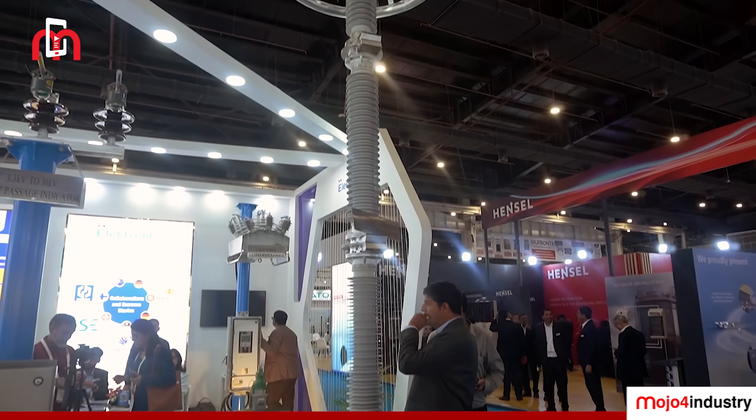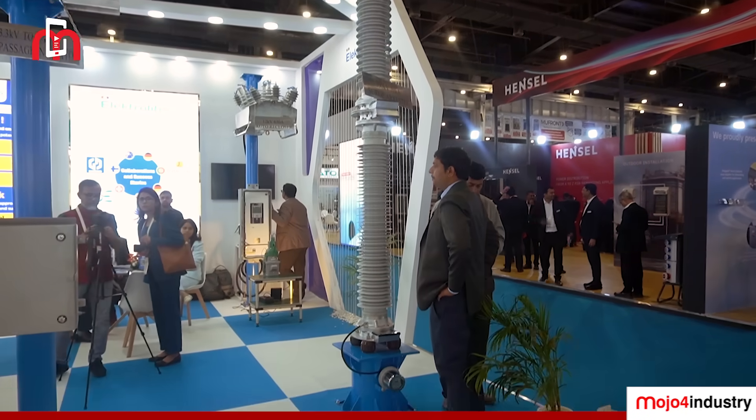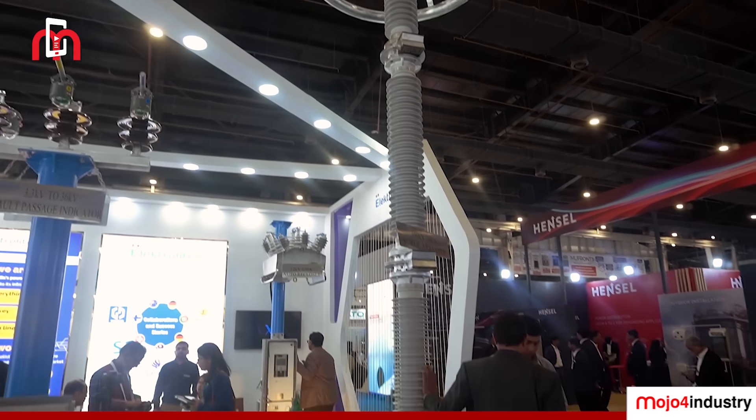We used to have incorrect failures earlier because we used to have an arrestor built within a porcelain housing. The porcelain housing, if there is a leakage, will take in water or moisture. When it expands due to a fault, the porcelain shatters, which flies in all directions like a bullet and will penetrate anything in its way. Today we have arrestors which are polymer housed, where this failure feature is totally removed from the design, giving you a very safe arrestor and a safe environment to work in.